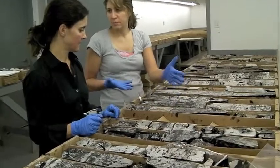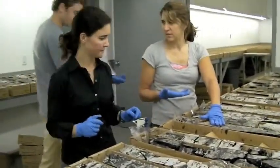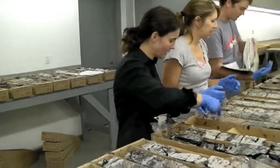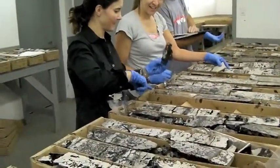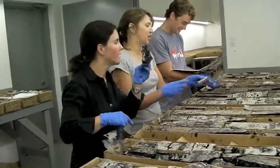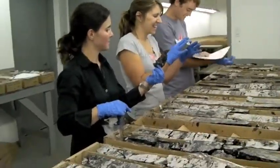Because you get a bias for what's competent — the less fractured, the less permeability. And look, even right below it — I want that. Tell me what the permeability of that is. I don't know, maybe 20 darcies. It would blow through the tool too fast.